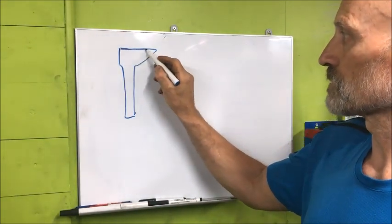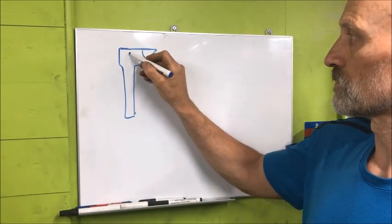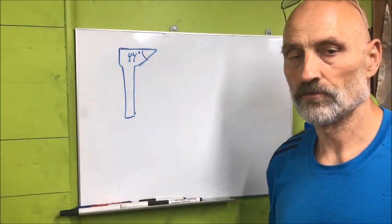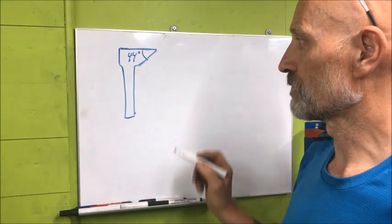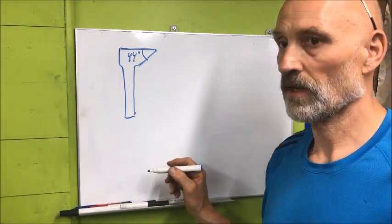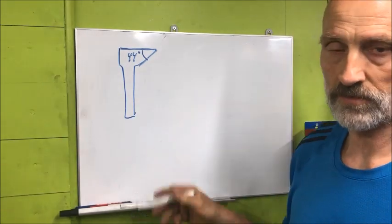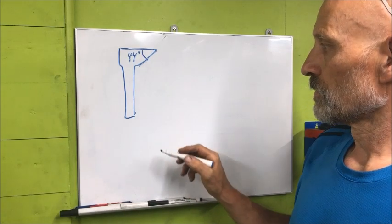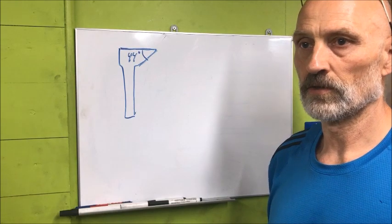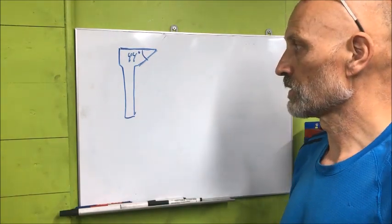So you have a flat section here, and you have a dovetail useful section here, which we decided when we planed it to be 44 degrees so that we can enter 45 degree dovetails, because we've learned that there is no point in trying to get exact 45 degrees or 55 or 50 or 60, because of, let's say, not really knowing how long it took, and it took a while as it turned out, to do what we did.